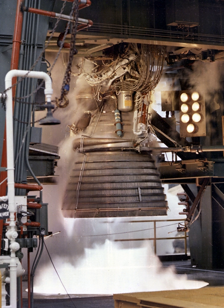The heat exchanger was a shell assembly consisting of a duct, bellows, flanges, and coils, mounted in the turbine exhaust duct between the oxidizer turbine discharge manifold and the thrust chamber. It heated and expanded helium gas for use in the third stage, or converted LOX to gaseous oxygen for the second stage for maintaining vehicle oxidizer tank pressurization. During engine operation, either LOX was tapped off the oxidizer high-pressure duct or helium was provided from the vehicle stage and routed to the heat exchanger coils.